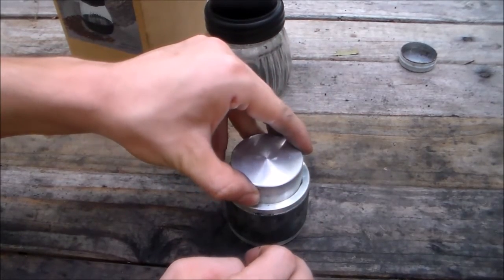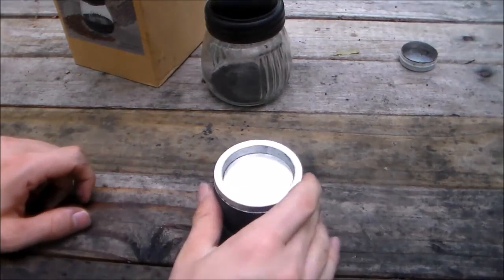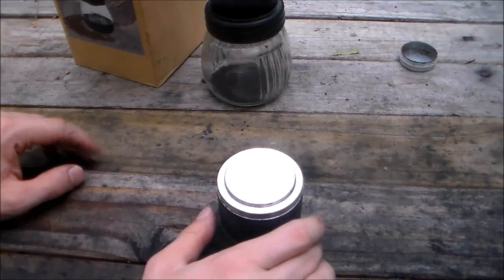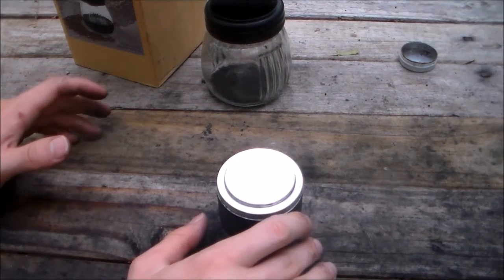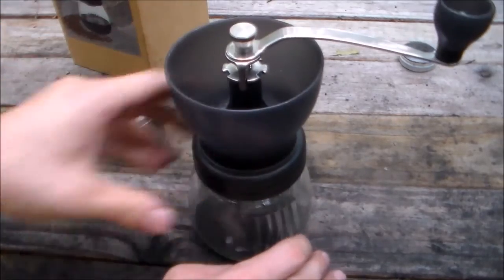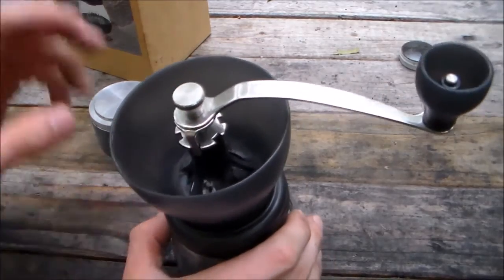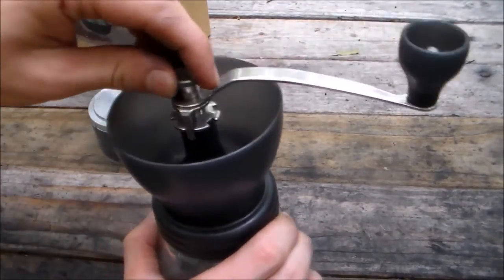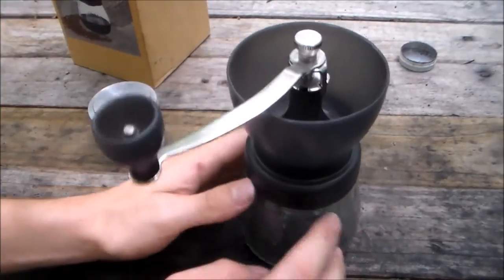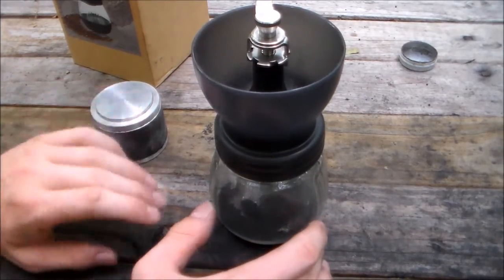Basically, you put it in the shop press — it's a six-ton press, so it has enough compression to press down your puck. Then you flip it over, and you have your puck in there, you bang it out, and it's basically just a puck, like a hockey puck. Let it dry for a while — it should be pretty hard. Then what you do is you break up that puck, and this is when your coffee grinder comes into play. You put the chunks in here, you grind it — break it with a hammer or whatever — then you figure out the grain size you want, adjusting the teeth to get like 2FG or triple FG, whatever. Then you grind it down, and once you compress and grind up all your pucks, you run it through your screen again for size, and then you're good to go.